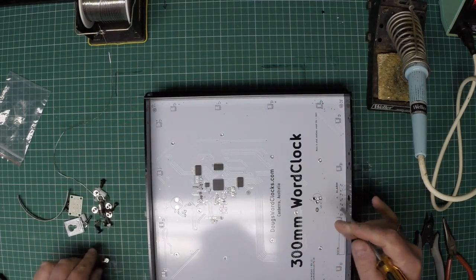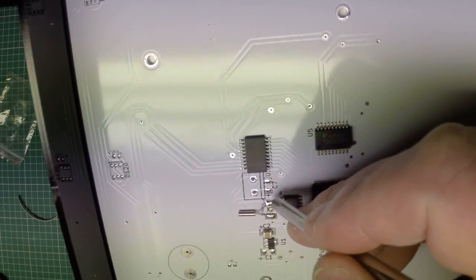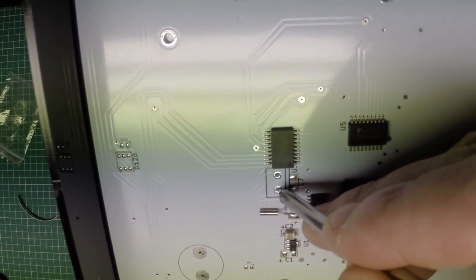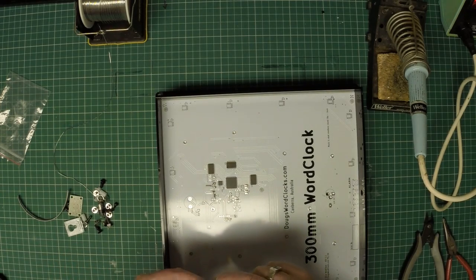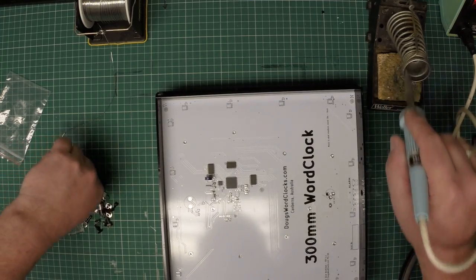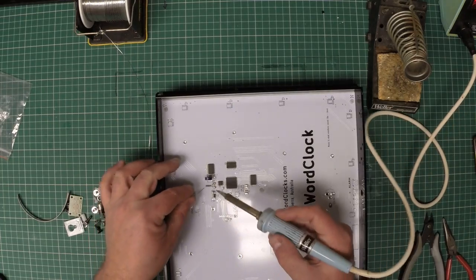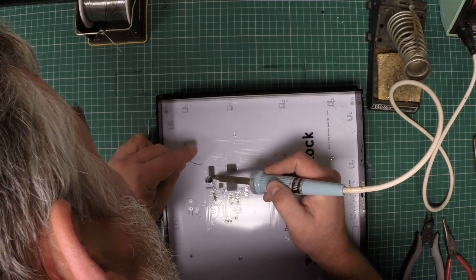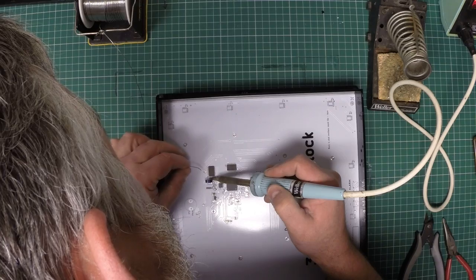You'll notice on the circuit board here there's a plus there, and of course that's minus, so that's positive, that's negative. We just need to install the supercapacitor with the negative lead in the correct spot. So let's do that step. Again, set it in, make sure the negative is in the correct slot, and a tiny little bit of solder, and then that's done.